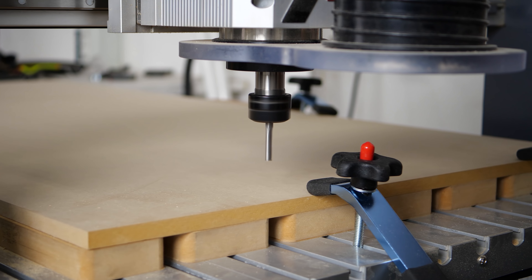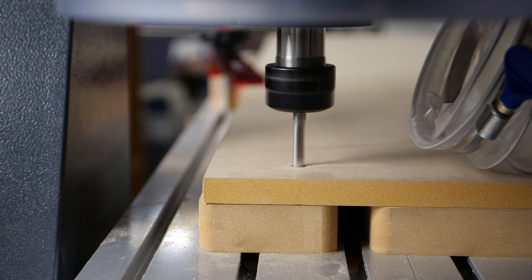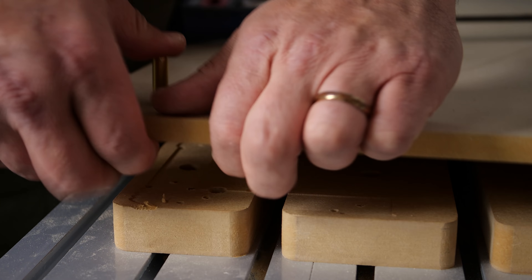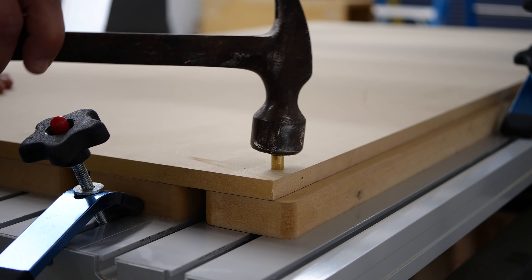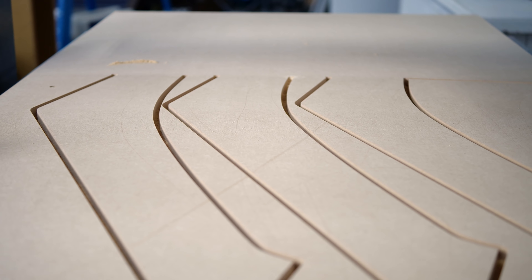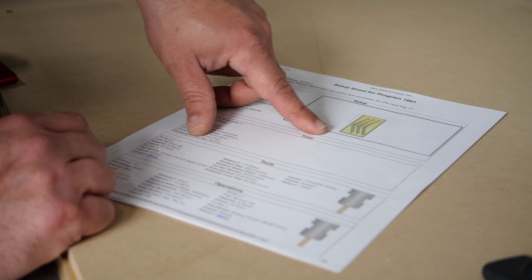When you simulate, you can see it cuts the second half of your board, and because you've used those locating pins it does it in the perfect location. Occasionally you might need one pass with sandpaper to remove a small nub, but otherwise it's good to go. We post-process that and head to the CNC. For pin stock — I'm using brass pin stock at 0.3125 inches — I cut them long enough to barely stick through the material so you're not worried about your retract height. I took some sandpaper or a file and rounded over the edges so they're not sharp. These are our locating pins.